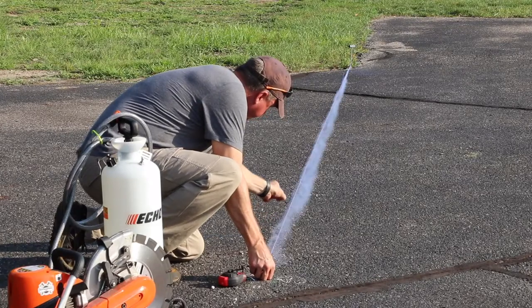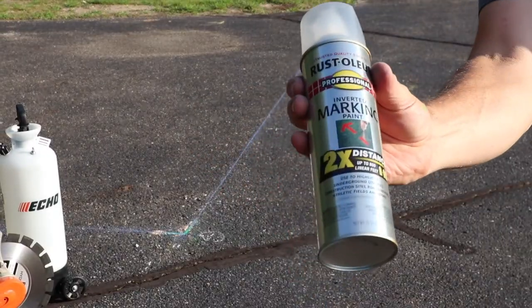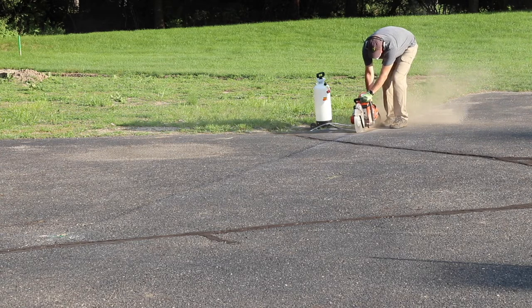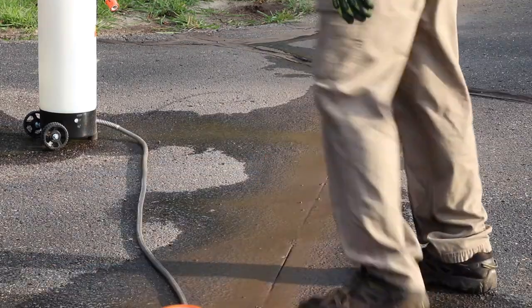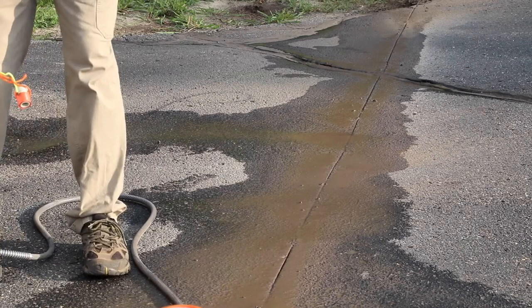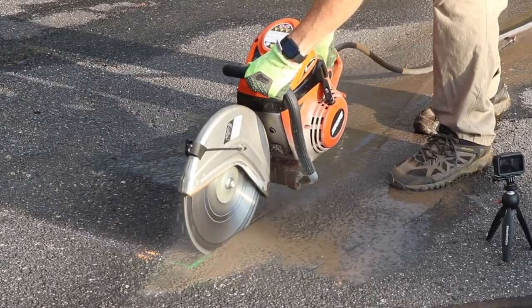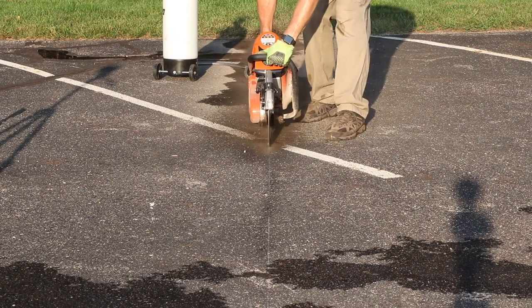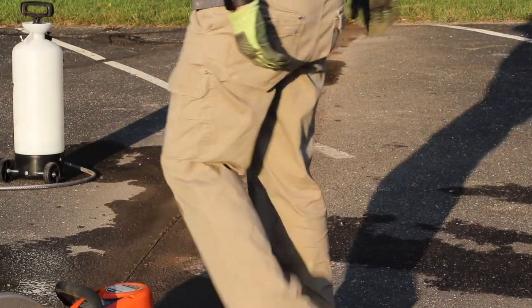Here's the interesting project I'm working on — I'm cutting out part of the parking lot to make room for a sand volleyball court. I'm using my chalk line and some upside-down clear marking spray that covers the chalk and keeps it from rinsing away from the saw water. I had to turn the water supply tank up a little bit because we were getting too much dust. I'm wearing an N95 mask, but we really don't want dust like that. Now I have the water turned up and everything regulated the way we want. The saw is moving forward — after a certain point we stop and move the water supply tank, since it has a 10 foot hose. I'm coming up to the end point, the intersection of the two lines, going just past it a little bit, then going the other direction. Just sometimes it's tricky figuring out what depth to cut at. Here's my final touch-up wrapping up this project. Now we're ready for the excavators to come in.